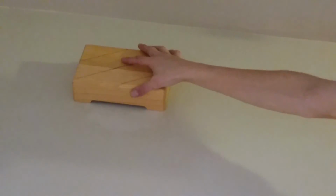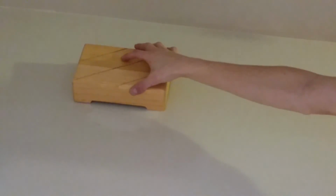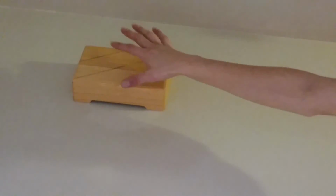Now the last thing to do is to take the chime's cover, and let me get it out of here without knocking the camera down the stairs. Okay, the chime's cover, and this stool's about to fall down the stairs, okay, there. And just slip it on like so. Hopefully it'll stay on. There. Now let's go ahead and give the chime a test. We run downstairs and reconnect the power to the transformer.